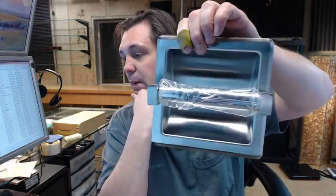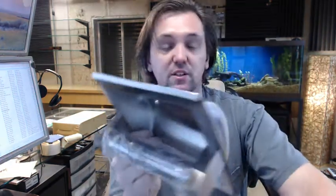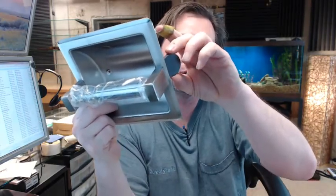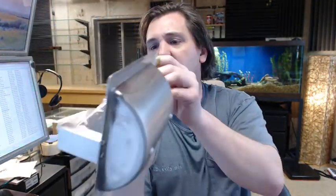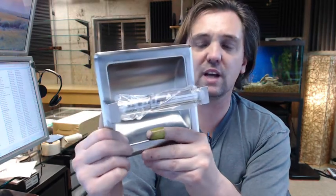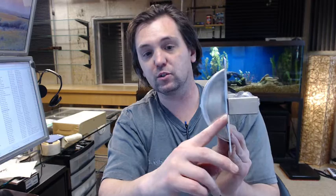This is made of 18-8 stainless, type 304, in a satin finish — a brushed finish. It is all stainless steel. There is a magnet here and there is no attraction at all. There is a small amount of attraction to the back side of these screws, but that is not necessarily something with a ferrous content — it is marginally attractive. It has obviously got some ferrous content to it, but that would be for strength to hold the bar on. You don't want to have to service that, which is why they do it with stronger screws.